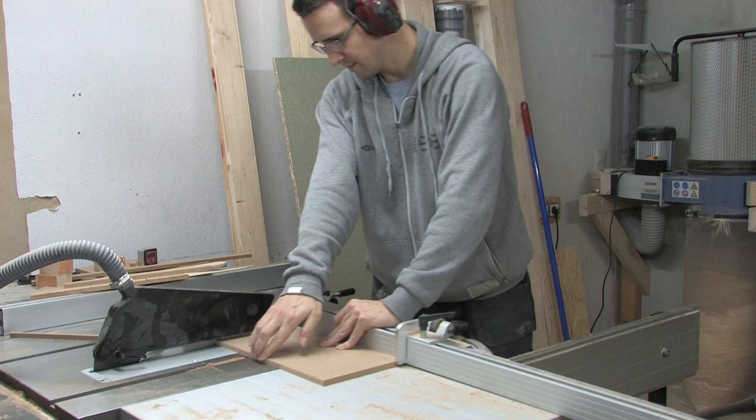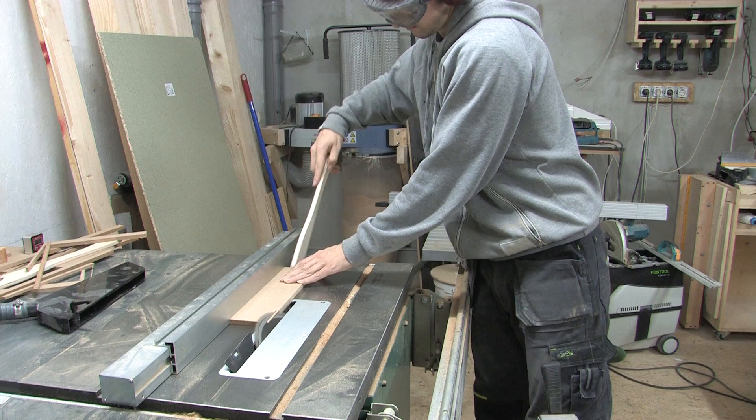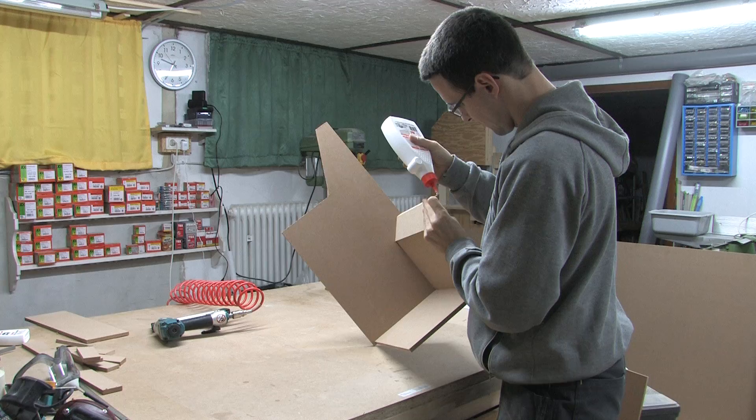I started the table area with an edge made of parts 1 and 2, and mounted the table on top of them. Part 3 gets a 45 degree angle on both sides to offer a glueable surface to the nearby parts. The next support is given by part 4 — be sure to mount it perpendicular to the table.